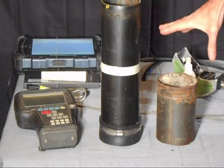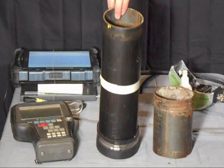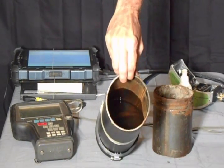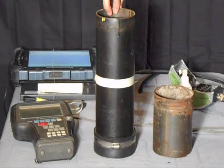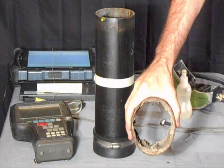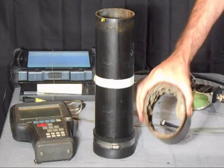What we've got here is two samples of pipe. One is a good piece of pipe which is filled up to the tape here with water — you can kind of see inside here that there's water in the pipe. This one, exact same type of pipe, both four-inch schedule 10 steel fire sprinkler pipe. This one obviously is corroded on the inside.